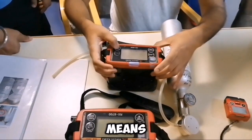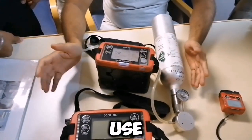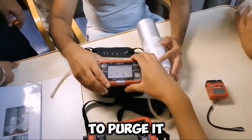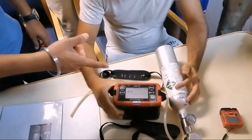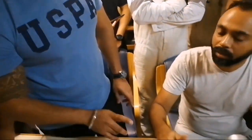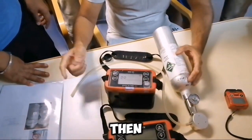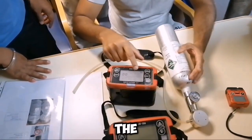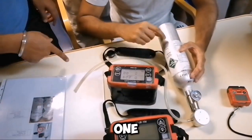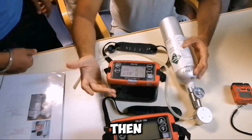Bump is finished — that means it is ready to use. Now you have to purge it. If the readings are not the same as the gas bottle values, it will show you fail. Then you have to do calibration — one by one each gas through one cal. If the bump test fails, you have to do calibration.